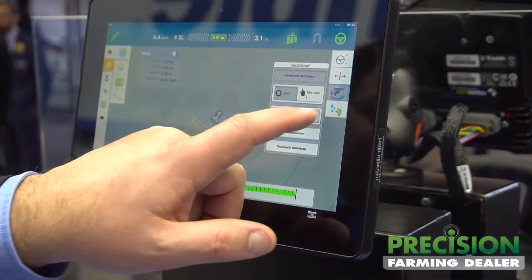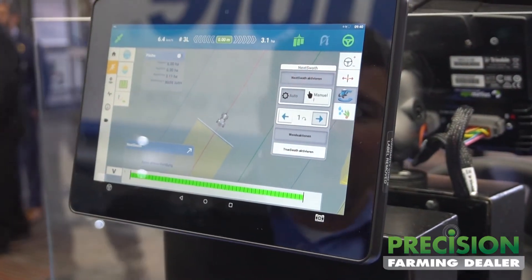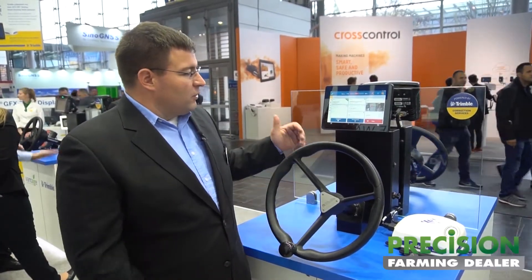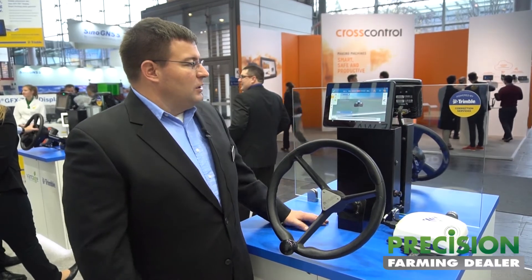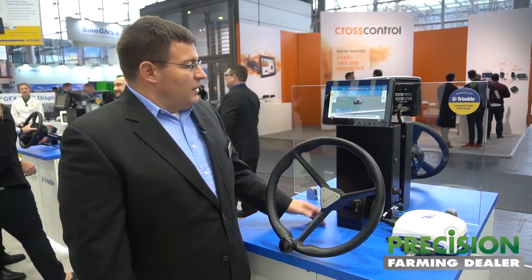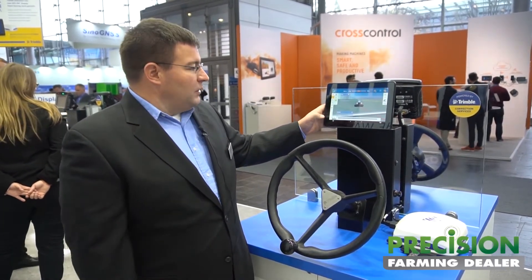You can always go back to the home screen to make modifications, see details, and see the progress of your job. If you have a field boundary set up, you can see how much of the job is remaining — how much of the field still needs to be worked, sprayed, or has application remaining. Now we can easily operate between the two different screens, and we have a number of different widgets that can be placed over the top of the run screen to give the user more updates on what's happening while going through the field.